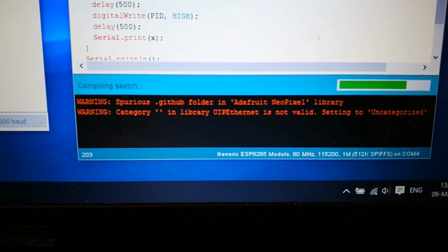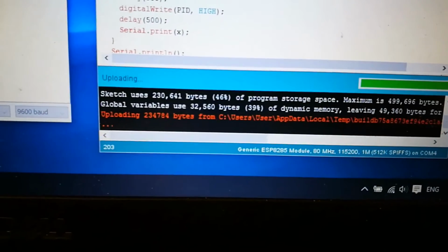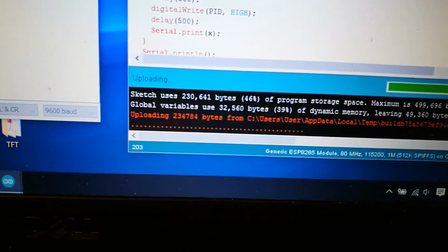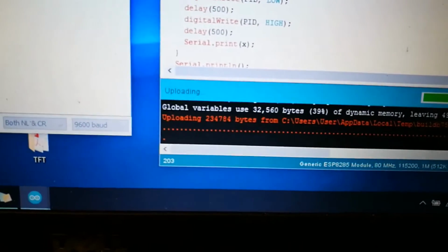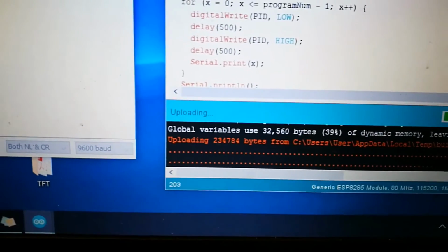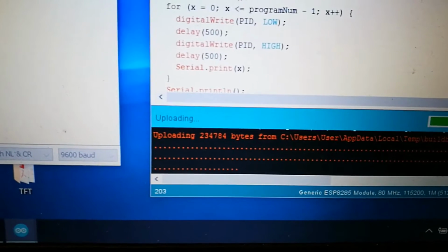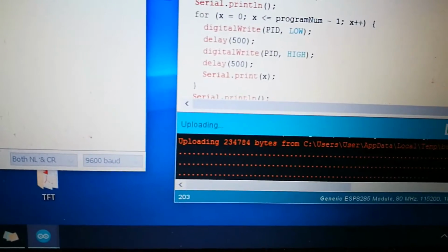Now, it does sometimes fail. They are quite, how should we say, temperamental little things. They have quite strict power supply requirements. They're only 3.3 volts, but it can actually draw quite a lot of current, and more often than not, more current than your USB port can provide. So it's normally beneficial to use these on a separate 3.3 volt power supply.